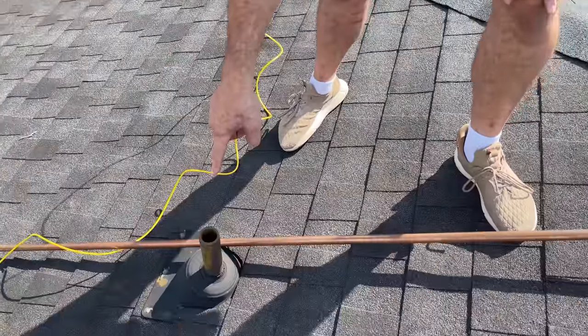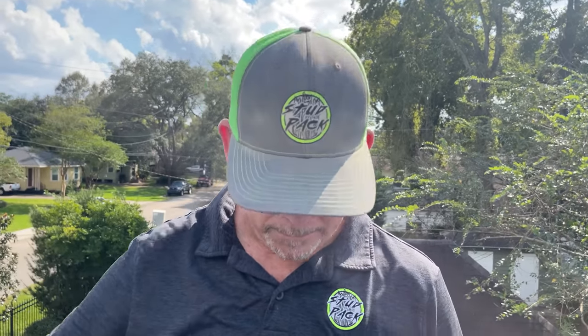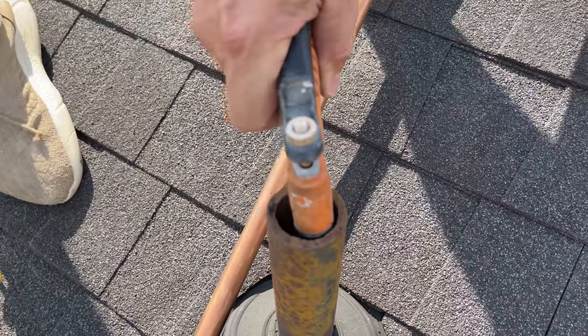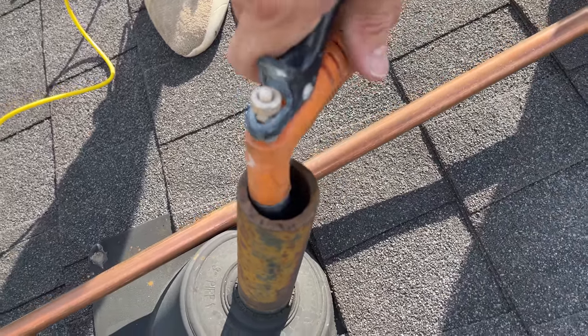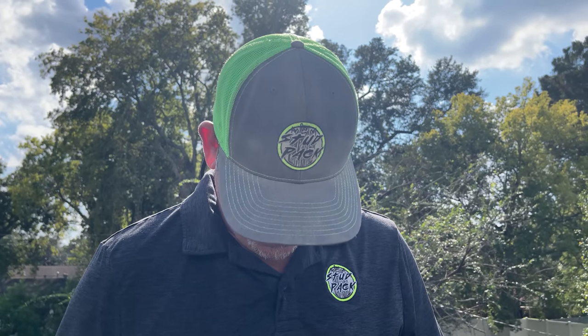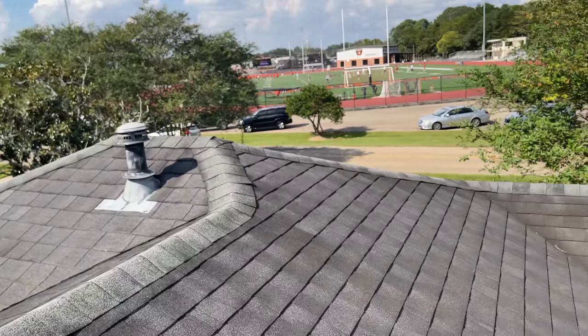We actually brought the garden hose up here. Before we head downstairs, I want to shoot some water in here to clean out the dirt and sludge that's collected in that pipe, wash it out, send the borescope back in — and if there's no water, we did it. We can go downstairs, take out that clean out on that double Y, and see if we've got some drainage — we should see water coming from the roof through the back of that T. But when we added water, the pitch changed — meaning it's filling up. We're not done.